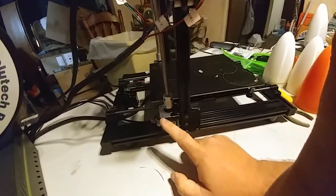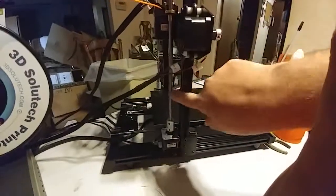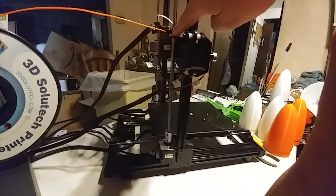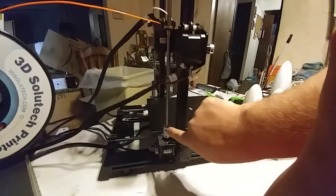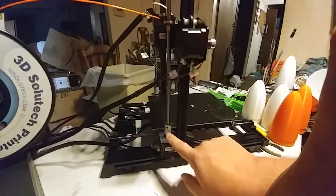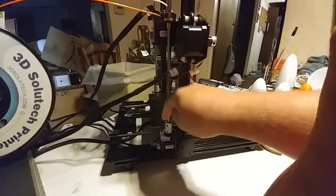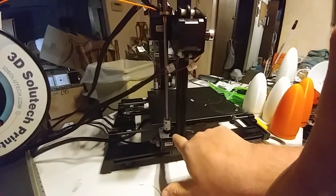Now that you have that undone, you'll be able to jiggle and rotate the stepper — you have to rotate it. You can't just lift because it's going through this threaded brass coupler. You have to lift and rotate to get the rod to come out of the coupler. Once it comes out, you've already loosened these, so turn the stepper 90 degrees. Allow it to rotate back into place into the coupler. Make sure it goes all the way in, then retighten the two grub screws and put the two screws back in.